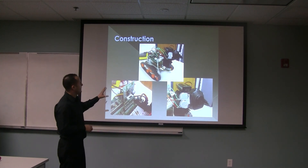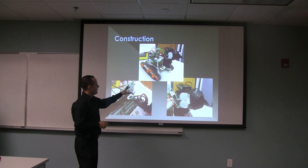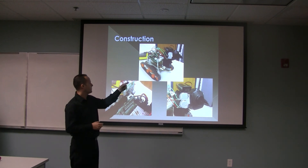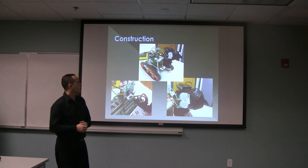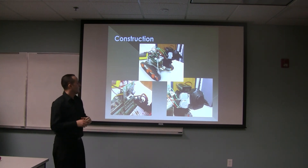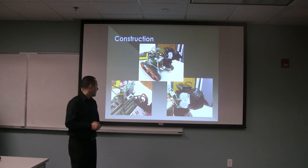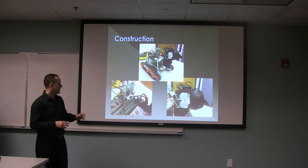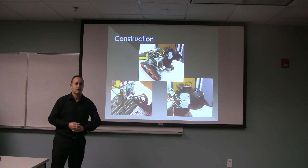This is the complete assembly of our wireless bot. As you can see, the tracks are already attached to the system. The mini wireless camera is attached to the pan and tilt kit. The camera is powered by a 9-volt battery, which rests on top of one of the servos. We also use LEDs for when we travel in the dark. This view shows the Bluetooth module and how it is connected to the main board, which is what we use to communicate with our wireless bot.